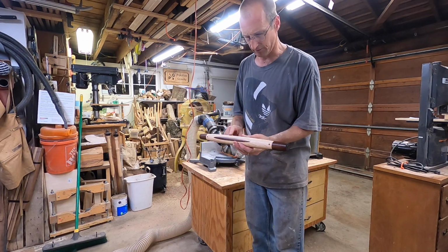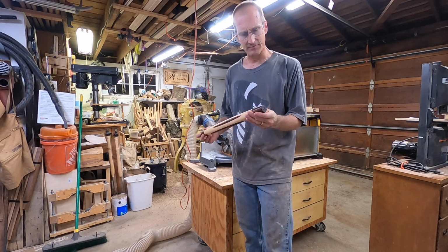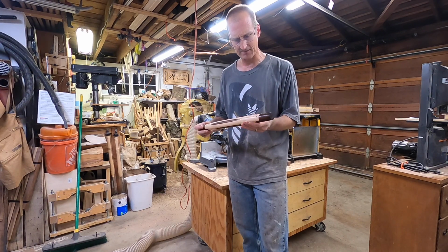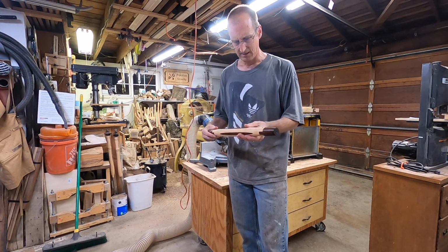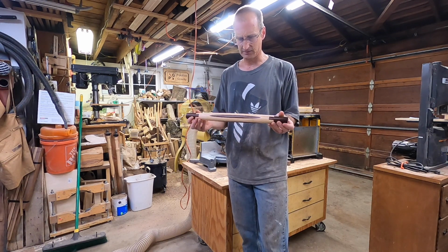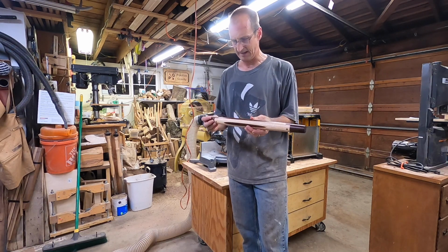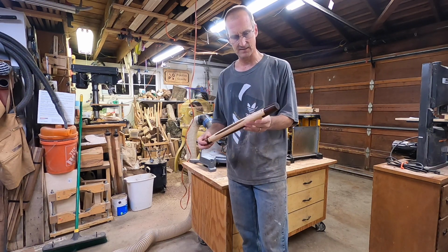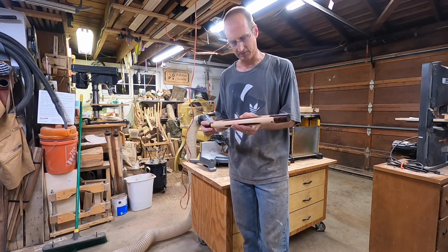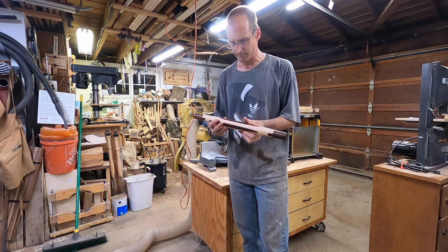I like the wood, although I don't know if my tools weren't sharp enough or if I didn't have this tool rest set at, you know, the ideal height or something. I was really having a hard time getting a clean cut. I was getting a lot of chatter, so possibly this was flexing or moving a little bit. So I had to do a lot of sanding. In the end, because this has so many imperfections, I didn't bother trying to sand out every little mark. I left, you know, there's still some scratches in here. But this was just a practice run.